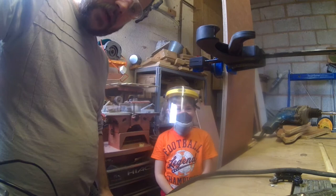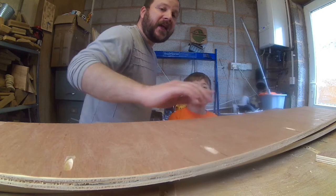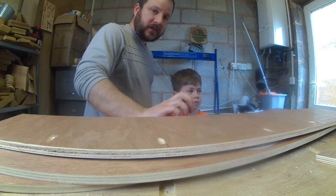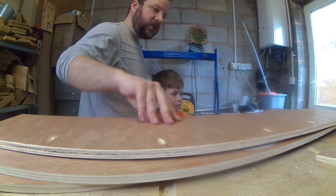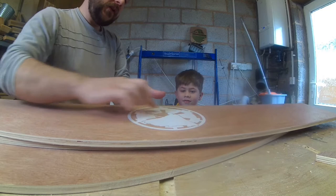We've finished drilling all the pocket holes — that was lots of fun, wasn't it Luke? We've got them all drilled now and we've got to paint these shelves white. We're going to do this outside but unfortunately the British weather's decided against that and started to rain, so I'm going to paint them on the workbench. You'll also see I've got some stencils on here, so we'll just paint over the top of those, peel them away at the end, and then we'll have the plywood behind with the rest of the shelf white.